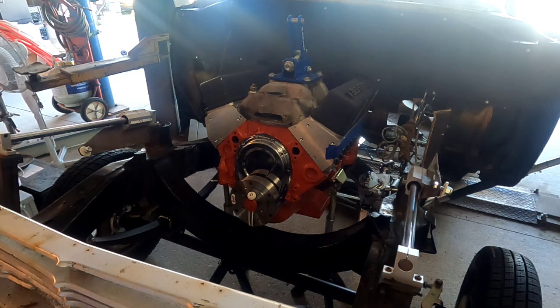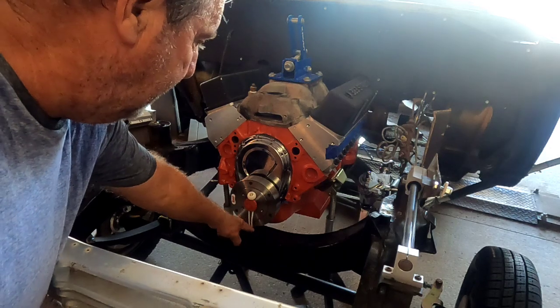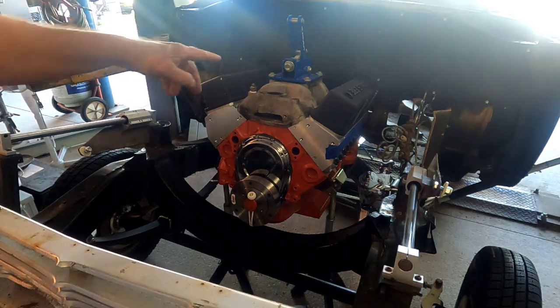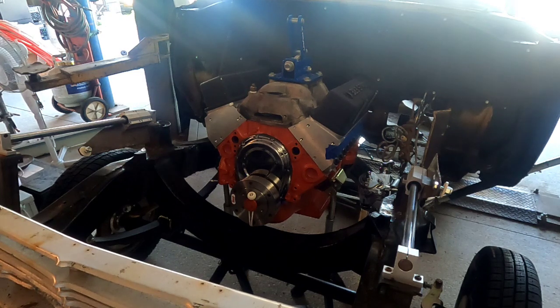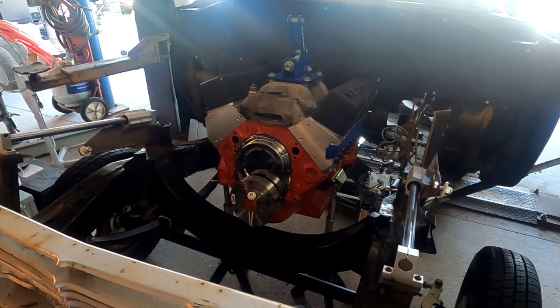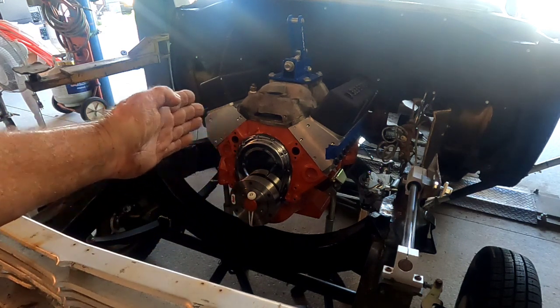What I'm doing now is I have a bungee cord with a string centered on the bottom of the oil pan going back across the bell housing all the way to the back, and I'm eyeballing alignment to the differential. On an 8.8 Ford or eight-and-three-quarter rear end, the pinion is offset to one side about an inch, so everything needs to be in the right place.